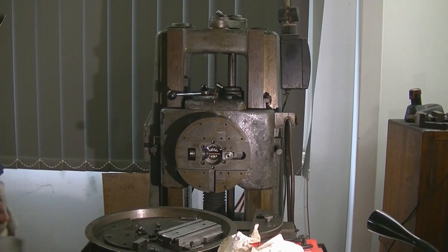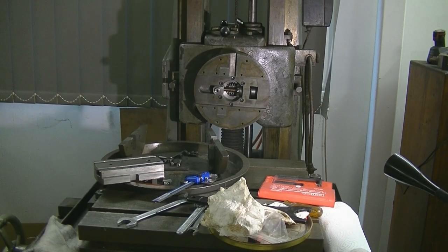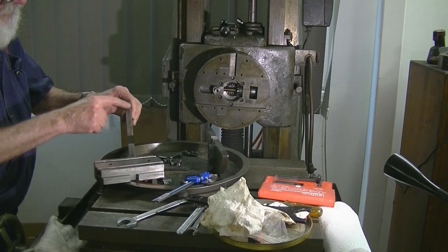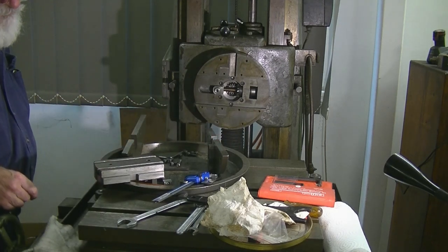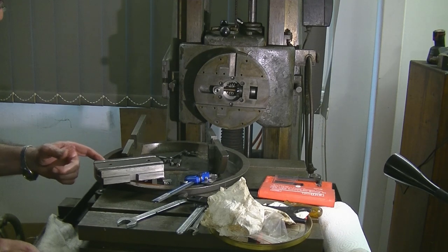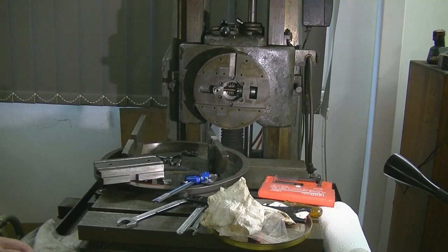There's a gander in the back of the feedway. Back again on the borer — I found a few surprises. Big surprise: this is a war-finished machine, even though the war had been over for 20 years. I don't really like what I see. These are the two slide faces and plates. This is a mating surface and it's just rough milled — not even finished. Same on the other side. Also, the previous owner has been pounding the hell out of the front face of the slide — I don't know why — but it's walled up the side a little bit. I'll have to lap that back and do a bit of a fit. I don't think this machine has ever operated properly.